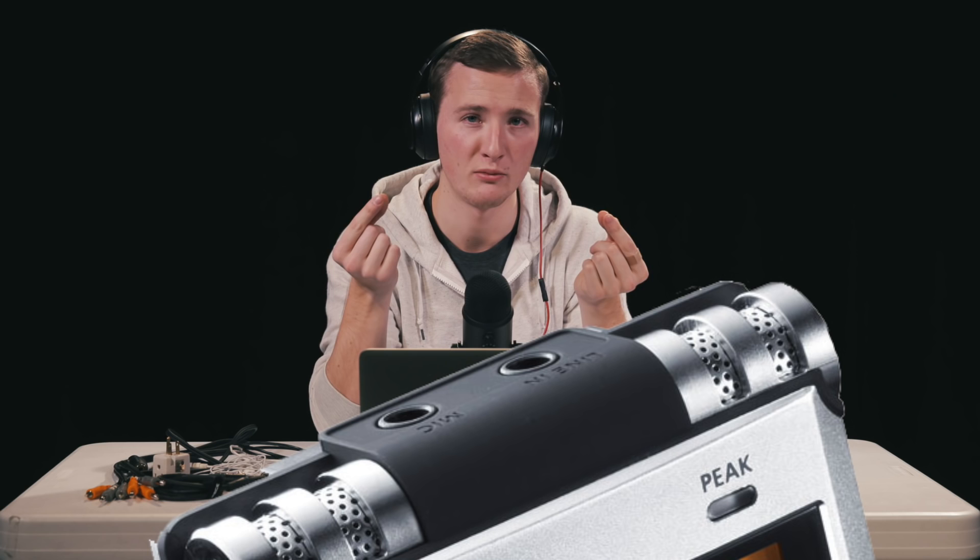If you look at my gear page for the starter kit, you'll see the Roland — it has two 3.5mm jacks on top. One is mic, one is line, and there's a big difference between the two. It took me a month or two to figure it out when I was starting out and it caused some problems. The mic input is a very low signal — you'd get that from lavalier microphones. But for board audio, you're going to use the line port because it accepts a much stronger signal.